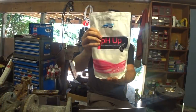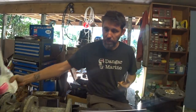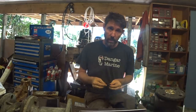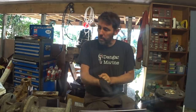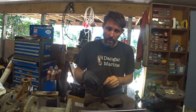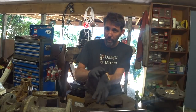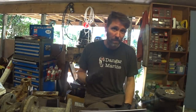Now I'm going to add the sodium carbonate to the tub. I just grabbed this from near the pool because it's used for adjusting the pH of pools — in this case it raises the pH, so it's an alkaline. I'm going to pop some gloves on and some safety glasses. The general ratio is about half a cup for 20 litres, so I'm going to put maybe a cup and a half in there.